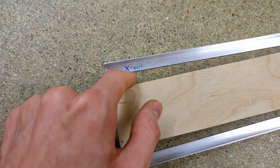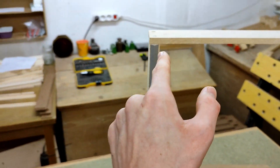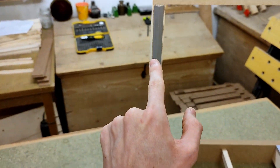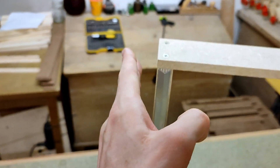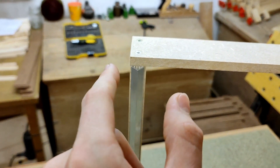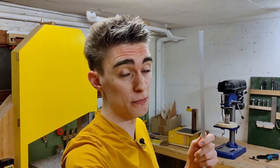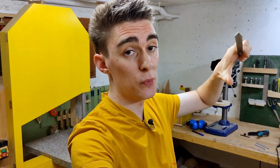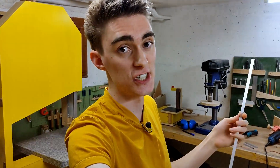I marked them all with the respective axes they go on. The way this is going to work is we're going to cut a dado shaped like a dovetail along the entire edge of the Baltic birch for the aluminum rail to simply slide into. That way we don't need to cut any difficult angles or use screws or glue to attach them. A huge advantage of doing it this way is the aluminum angle stock can easily be replaced when it gets worn out, plus the aluminum-wood sandwich won't bend like a bimetallic strip when the wood expands and contracts due to changing humidity.